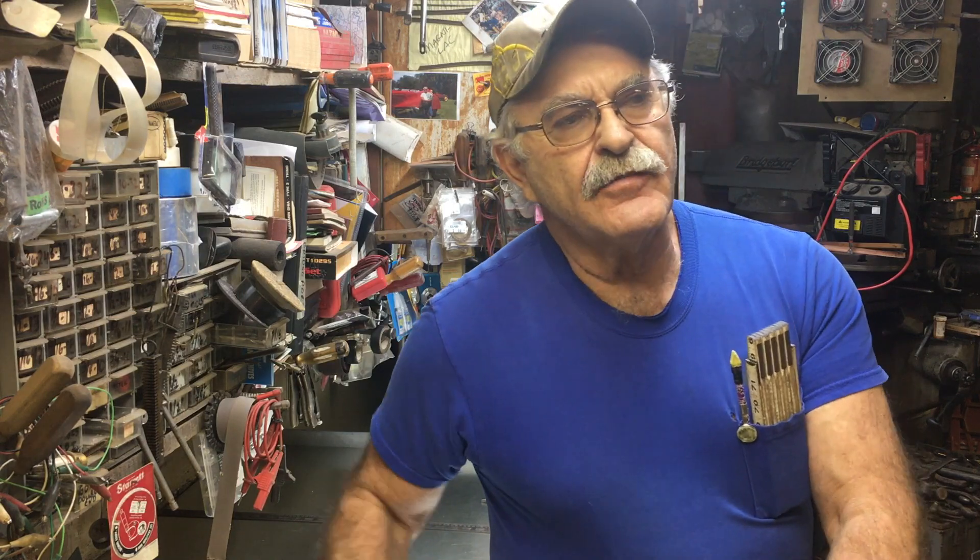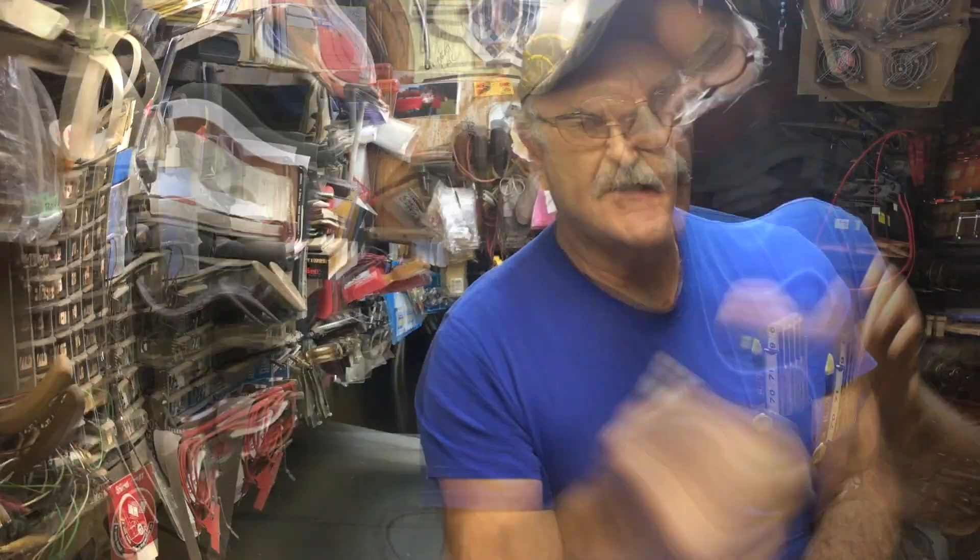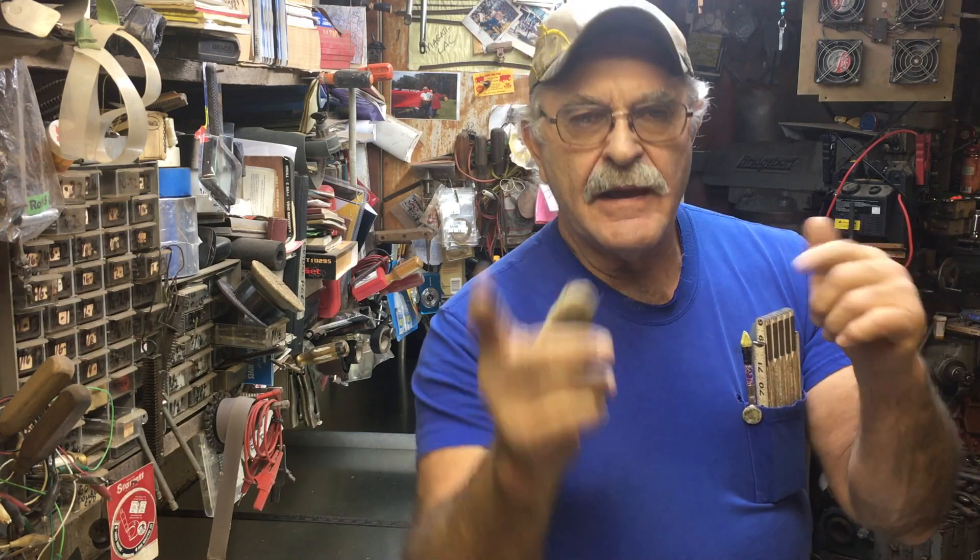But today we're going to go one step farther. You've got to get your air back to your furnace, and that's called the return air system. And once you get your trunk line all the way back by the furnace, you've got to make the return air drop to go down and go into that furnace. So today we're going to concentrate on making a fitting or two in that return air drop.